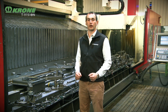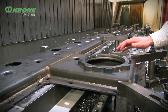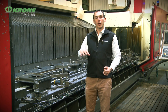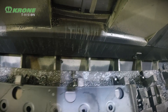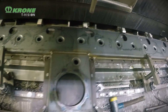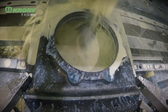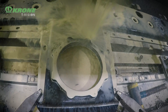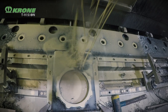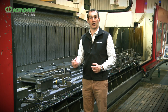To ensure that everything is running true and in line, we take the mower bed, mount it on the milling bed table, zero the location, and a computer-controlled milling machine ensures every surface is flat and true, and every hole is in the right place. This ensures that as we mount the gears and the bearings, they're in the correct position and alignment, running straight and giving us a more efficient drive while avoiding any losses.